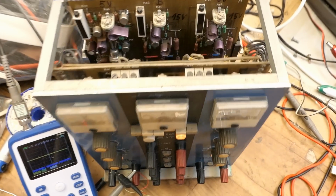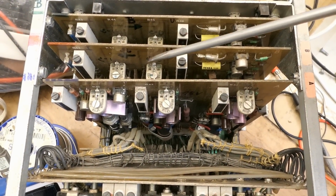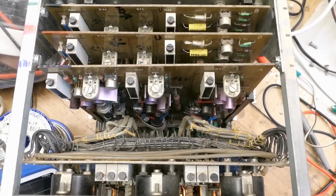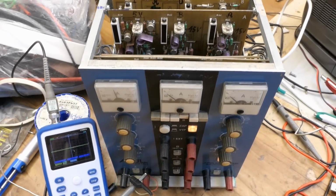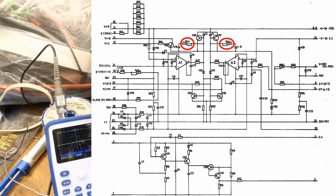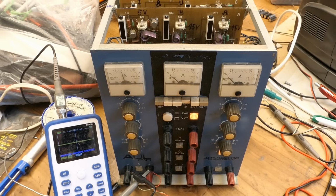And I'm going back to the adjustment potentiometers, which are on the adjustable section control boards, and these are some sort of PID regulation or oscillation compensation, basically a negative feedback in the overcurrent and voltage regulation connected to the voltage and current op-amps. And each potentiometer is in series with a 100 nanofarad ceramic capacitor, and it has to be set in such a way that the power supply doesn't oscillate. Each adjustable section has one potentiometer for the voltage regulation and one for the current limit.